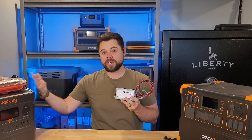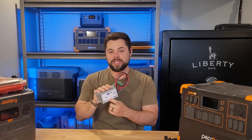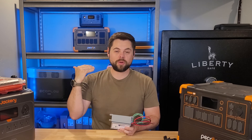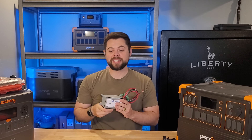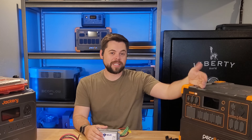The confusion comes in because this says 600 volts but it's covering a unit that goes down to 450 volts. The reason is that there is a tolerance with each one of these EMP Shields that extends beyond the range listed. So for things like your Apollos, your Delta Pro Ultra, your 6000 XP, 12000 XP, 18K PV — those types of solar inputs — you're going to want the 600-volt EMP Shield.